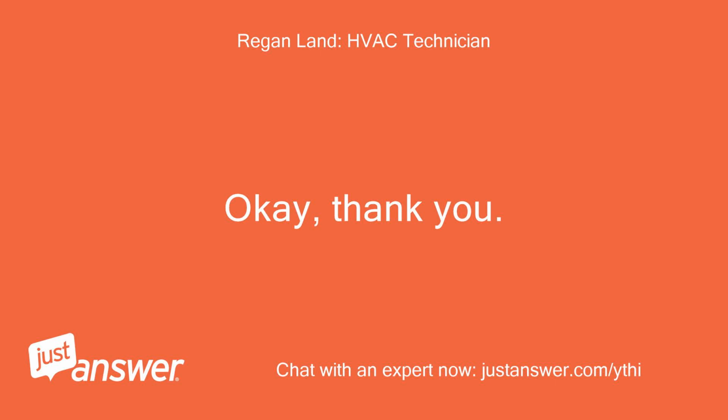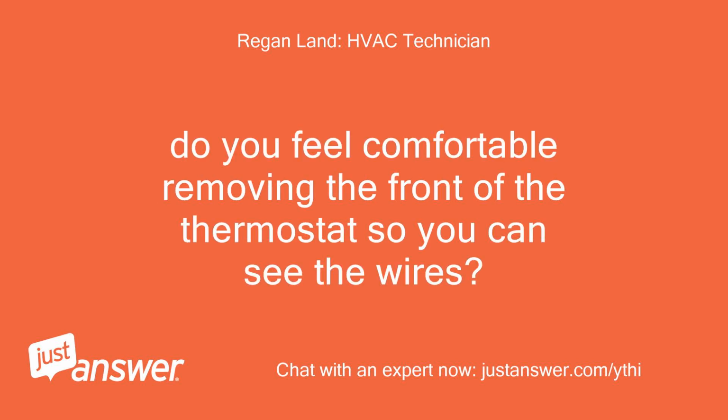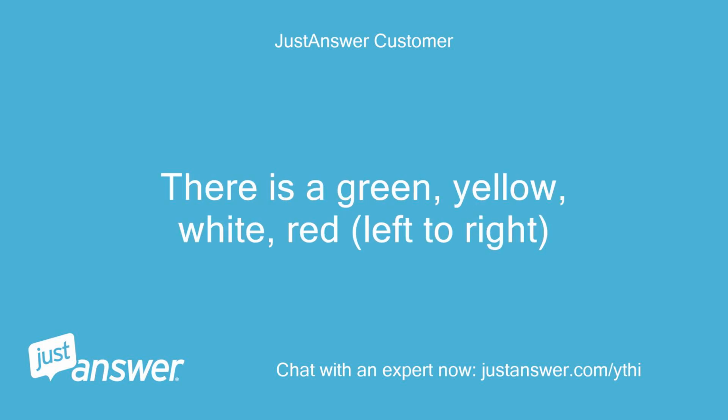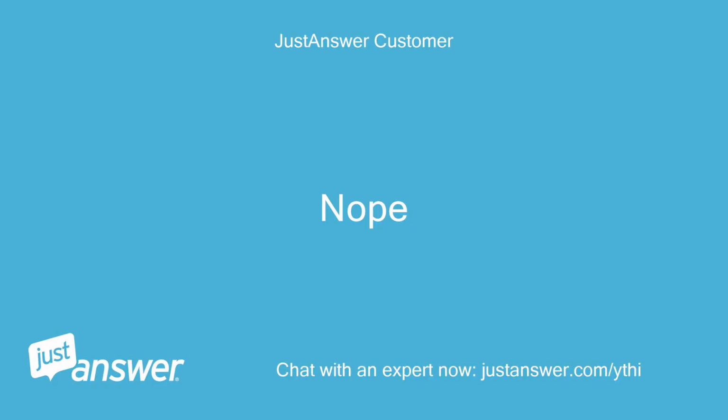Okay, thank you. Before we check installer settings, do you feel comfortable removing the front of the thermostat so you can see the wires? Yep, I'm good. There is a green, yellow, white, red, left to right. Okay, go ahead and remove the face and let me know if there are wires connected to the S1 and S2 terminals. Nope.